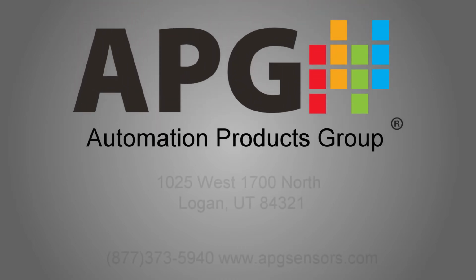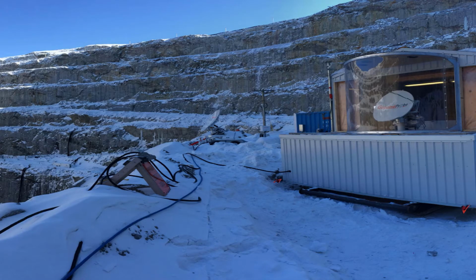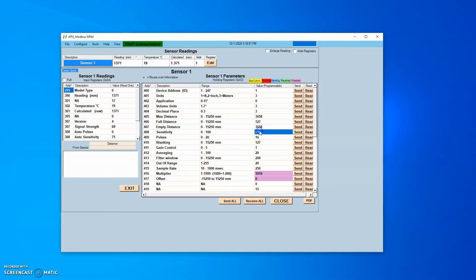Ultrasonic sensors are a versatile and powerful tool for monitoring distance and levels of materials. However, they do require knowledgeable care to correctly configure them for more complicated applications, including extreme environmental conditions or sound-absorbing measurement targets. Several parameter settings are available for adjustment to compensate for environmental factors.